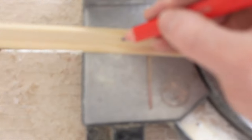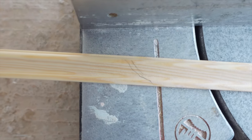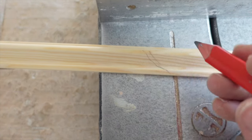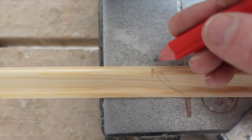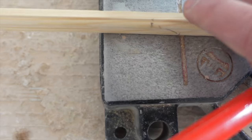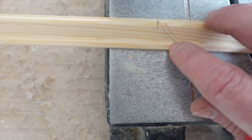Now I want to measure end to end and start cutting. All these cuts need to be mitered — where the cuts meet, we need to have an intersection at a 45-degree angle. This means that when they join, they'll all be joined nicely. You get your measurement, then you miter it from the furthest point. Say this is the furthest point of the cut — you want your miter to end at the furthest point and finish at the shortest. Make sure that your profile is correct: the thickness is at the top and the lower detail is at the bottom.